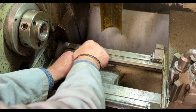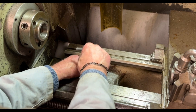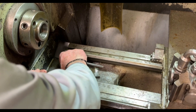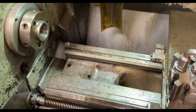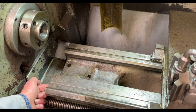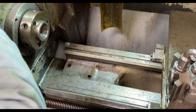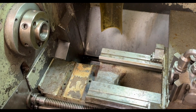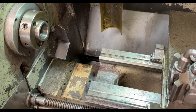Now I have to remove the plate that fills the gap in the wall. I have to remove these three cap screws here, and this one, and these three — so that's done. There are two more, one here and one here, going in that way. Now that these screws are all removed, I should be able to lift that out and we have a gap in the lathe bed, which will make it a lot easier to turn large items.